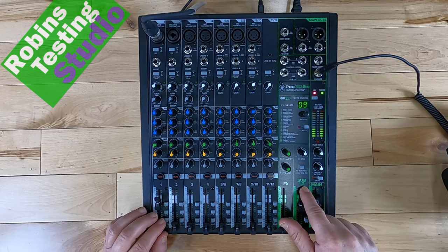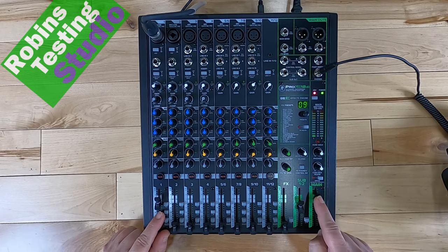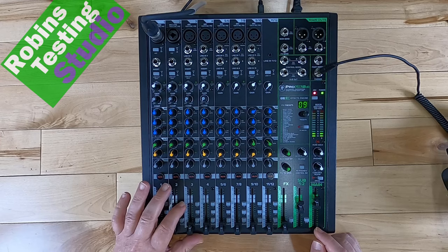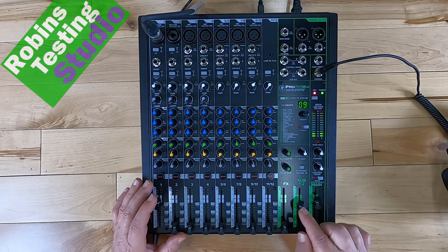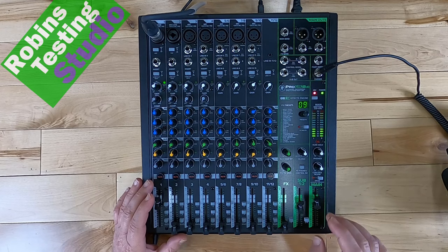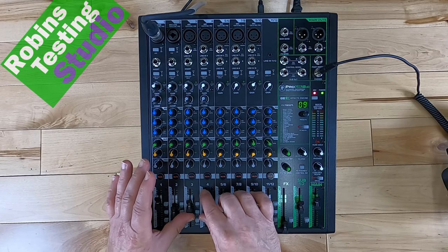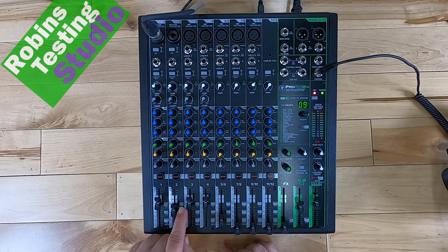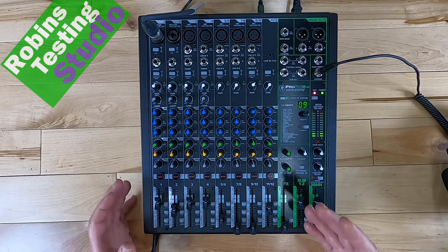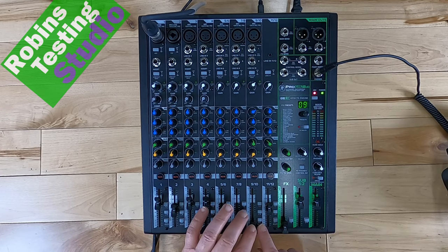On this side here we have sub 1 and 2 and a main. This allows us to assign each individual channel either to the sub or directly to the main. If I have just the lead singer, I can give them left and right straight to main — they're going to be part of the main output. If I'm grouping, say, three mics for background singers, I can put them all on channel 1 and 2, allowing me to adjust the volume. You're going to probably set some people up first, listen to them, and then have the lead performer do it on their own. The idea is that after you've made your adjustments on everybody on channels 2, 3, and 4, by choosing channel 1-2, it allows you to then just turn that whole package up and down from here. If I have an announcer set up on channels 9 and 10, I can engage and disengage them just with that.